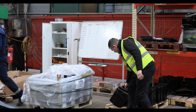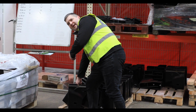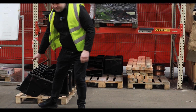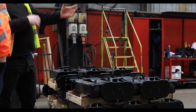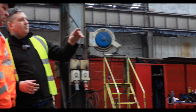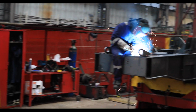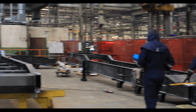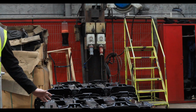Oh, okay. Yes, so it comes from the same producer where you buy the axles. For example, SAF have their own hangers, BPW their own, but they all look very similar. And after that, that will get welded on the main frame and the legs. Some of the producers paint them separately and assemble separately, but we usually put it on at this stage, on the chassis, and it goes to the paint shop together with the chassis frame. Because on all of our trailers, the legs are the same color as the chassis frame. Some producers just leave it black, the original color.